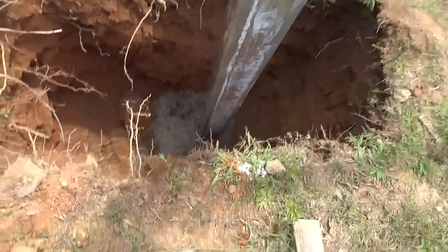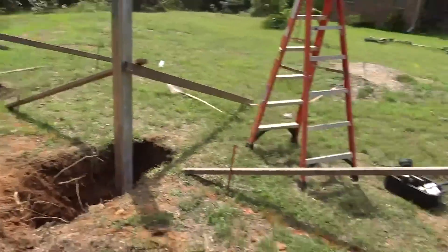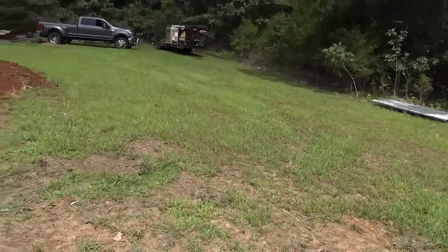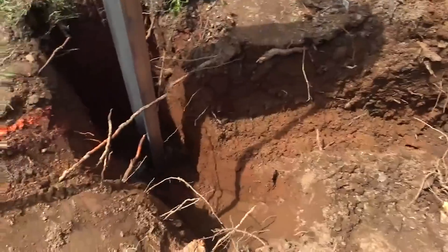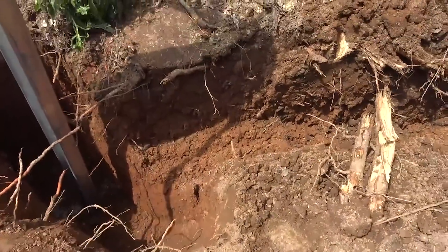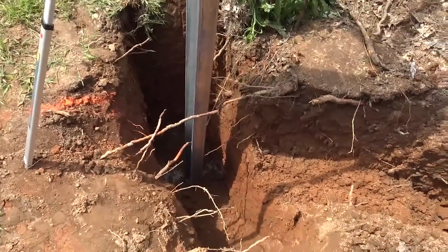In this PLP Powerpeak there are six holes and we had about a two-foot drop in grade, but the minimum embedment on the lowest hole was 26 inches and we're at 42 inches, so we're good. We just prop the posts and get them ready for concrete. We also started preparing the conduit trench — we'll stub up for power with a pull box and a two-inch conduit coming down, so we get that set before the concrete truck comes in.